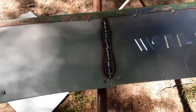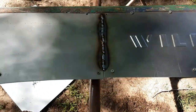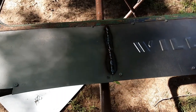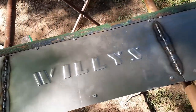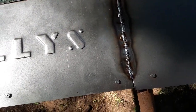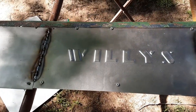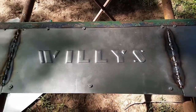Alright, I got the things off, cut some tacks. On both sides I've just been tacking and hammering. About to flip it over and do the back side now. Alright, got it welded — they're ugly but they're okay. Had to do little tack-hammer, tack-hammer cycles to get it right. It's probably going to have some waves in it but it'll be okay.